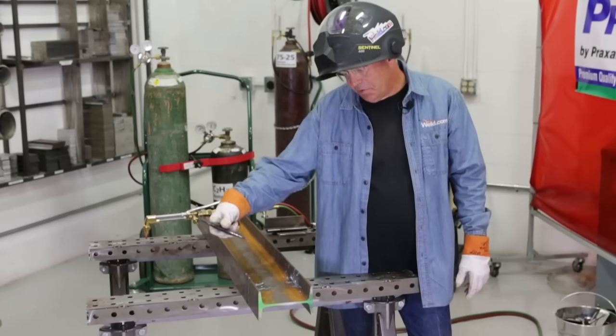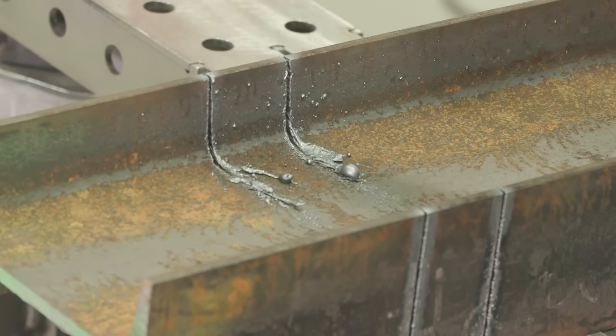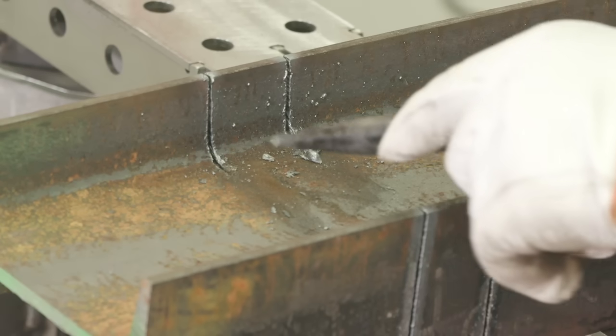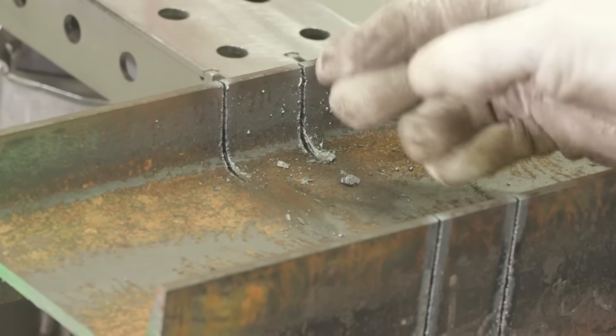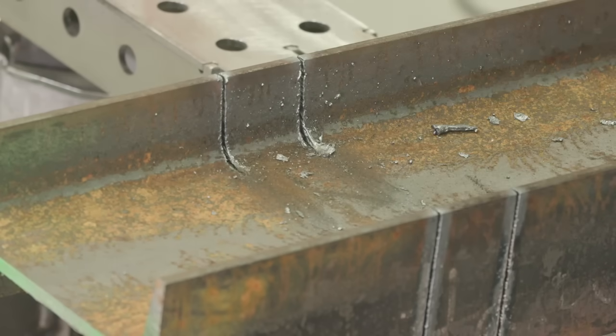I have two pierce marks in here. As my cut came through the flange, I pierced down into the web and through this radius. Sometimes they'll line up perfectly straight, but the main thing is, before I continue on, I need to come in here and get rid of this stuff so that it doesn't disrupt my other cuts. My next cut is to come in here and waste this flange piece. I may just bring it out square, and since I'm going to clean this up with a grinder, I may just do the radius to match with a flapper wheel because it'll happen pretty quick. I kind of need to clean up some of this slag on my beam.